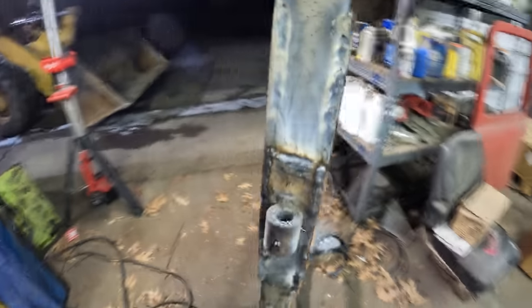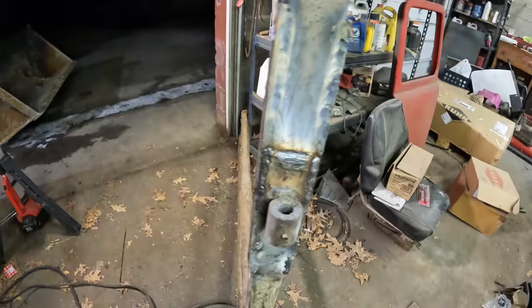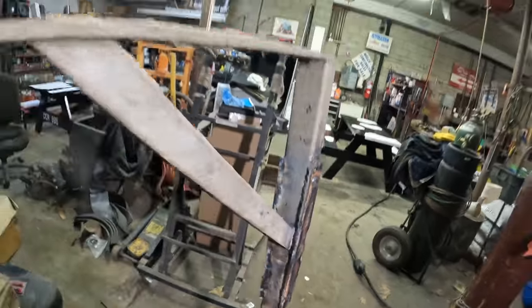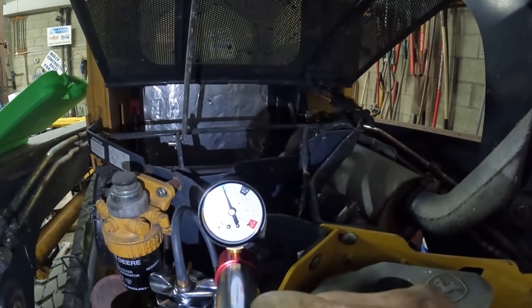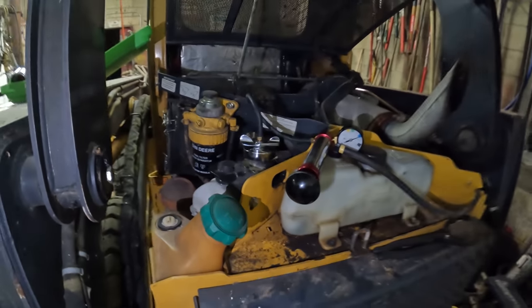All done up now. Reinforced all of that. I thought about trying to plate it but it's going to get in the way. That will definitely help quite a bit — we've got everything done there. We'll let it cool down and I don't know what I've got for paint to paint it over — might have to get some galvanized paint. This has been sitting and it's not really a good sign because now it's down into the 13-14 PSI range. I'll pump it back up to 15 and then we'll check it before we leave tonight.